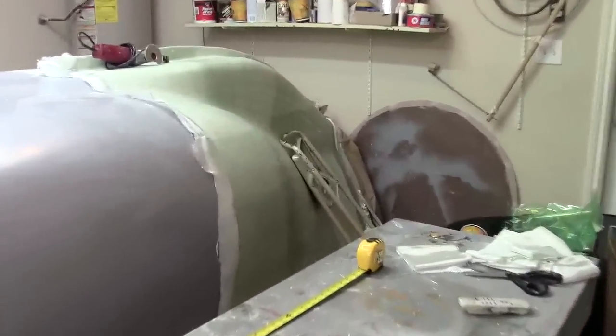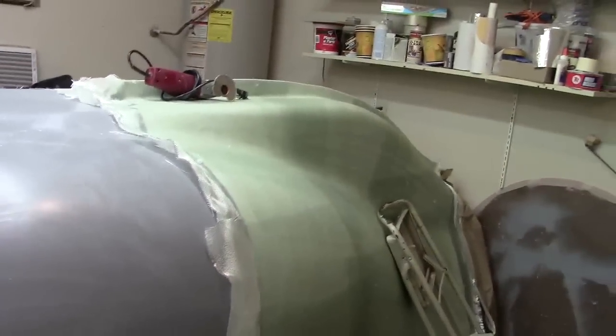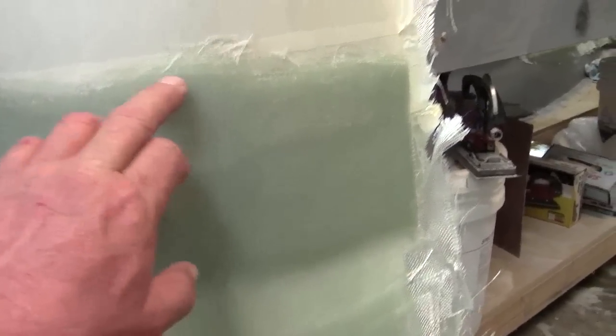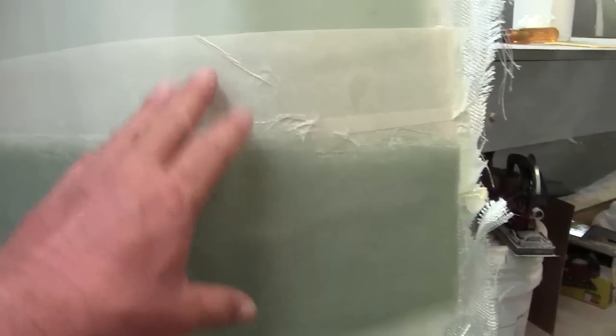This is our first part everybody — we actually got a part laid up. We made these halves yesterday. There's that top mold right there, and we molded this up just like we did the back half. See the back part — that's all molded, both sides are done. We laid these up yesterday and this morning but we didn't actually glue them together. See this tape? Instead of seam taping them together, that's going to make a flange — there's about ten layers on that flange so it can be screwed together. So these are actually still two parts when we take it out of the mold.